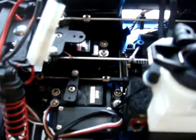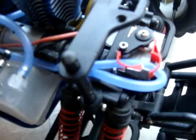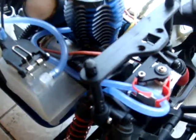Of course, when you center that servo, you're centering this one, which is effectively putting the gears into a neutral position, as it were. So you wouldn't do this obviously when the car is moving. Obviously you stop the car, you center the servo, which then stops the car. So that's the idea of how it works. You're not having to add an extra channel to control it separately. You're now using the same channel, you've just put two servos on it via a Y junction, which you've got plugged into the transmitter's third channel, and then this servo and the other servo just plug into the two ports which go to that Y channel. So that's how that works.